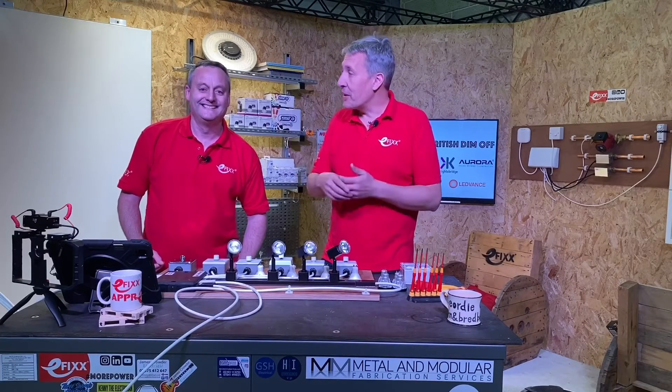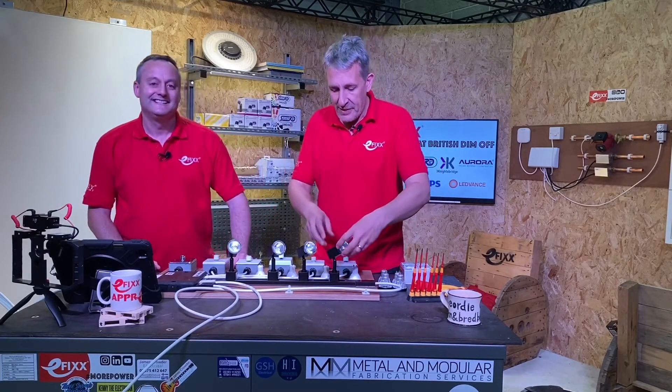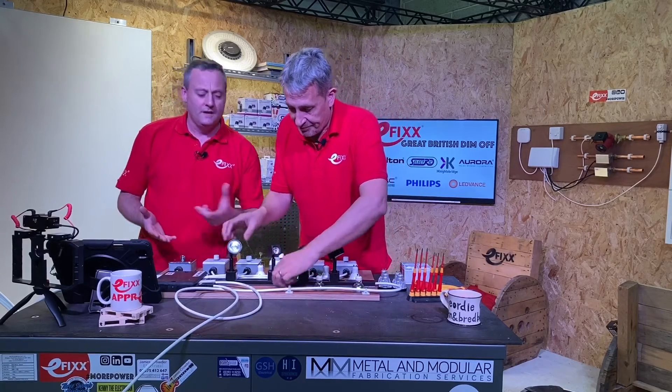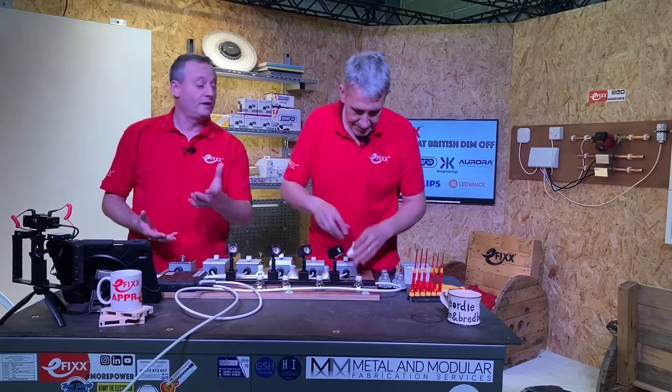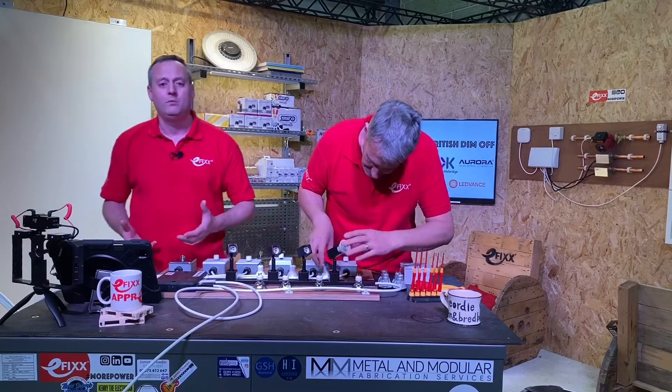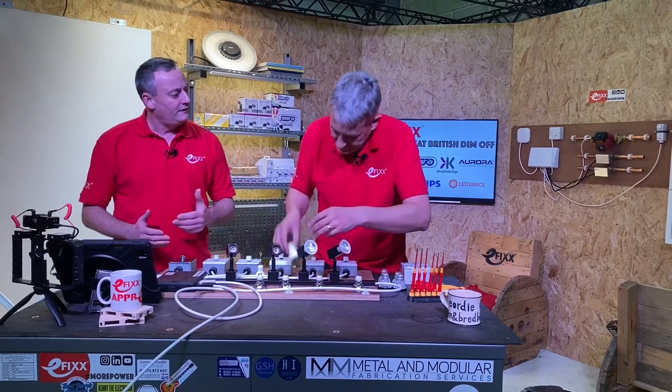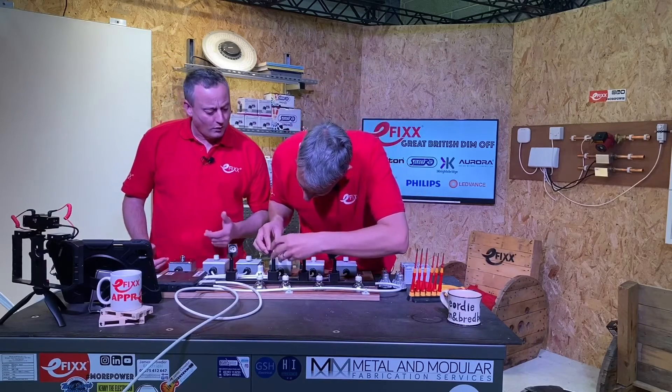You're probably going to have to upgrade to LED. While you swap those out, the likelihood is one or two lamps may have failed and you've decided to go a little bit more energy efficient — taking out 50-watt halogens and putting in 5.5-watt LEDs. That can create a problem when we look at dimming this circuit.